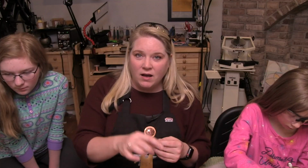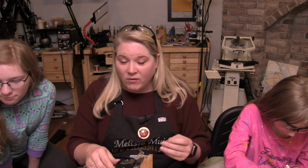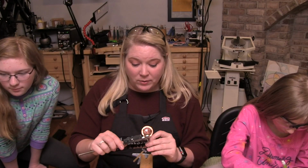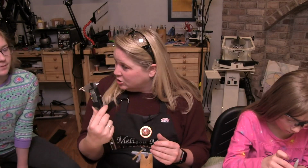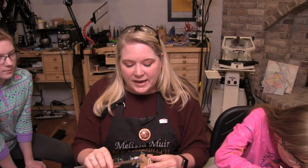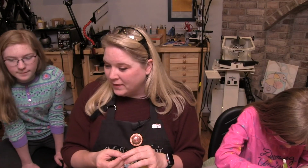What I'm starting to do now is measure that wire and write that measurement on the bag and the file folder. So now when I go to look for 12 gauge, I will see, oh, I believe 12 gauge is about 2 millimeters. And sure enough, 12 gauge is 2 millimeters. So when I say I have a 2 millimeter wire, it's talking about its thickness. All right?